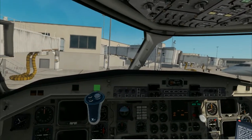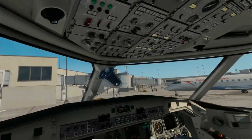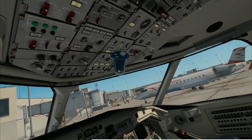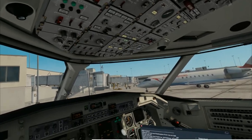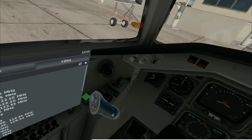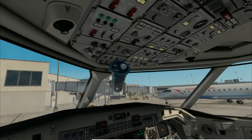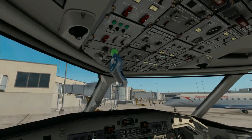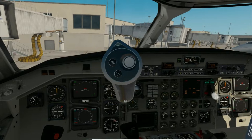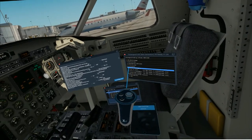We can go ahead and turn off our Master Caution Warning lights, and we'll start by turning our beacon light on — that's the first external light you always turn on on any aircraft. We'll follow with the rest of our external lights, except for the taxi and the landing lights, because we don't want to blind the pushback guy. Go ahead and flip on our three avionics, which allows us to access our navigation systems. We'll pull up the oxygen knob on the first officer's right armrest and push down the tiller knob, which unlocks the nose wheel so you can turn via your rudders when taxiing. We'll also turn the knobs for the center panel and left instrument panel lights.